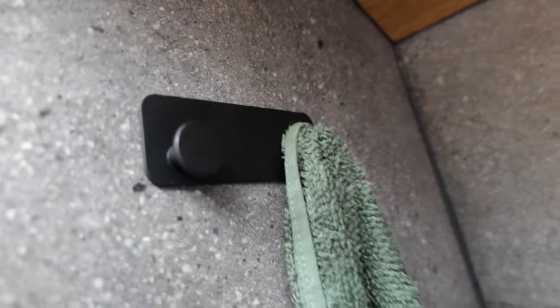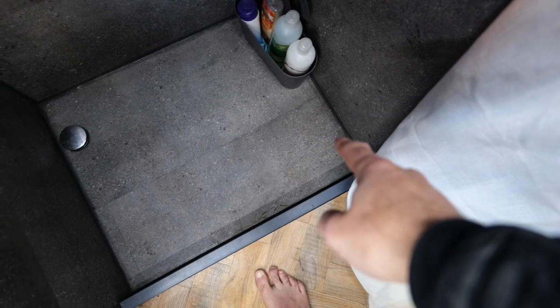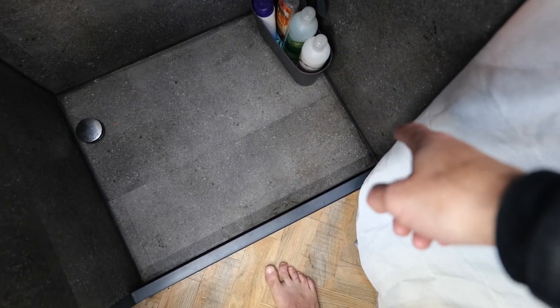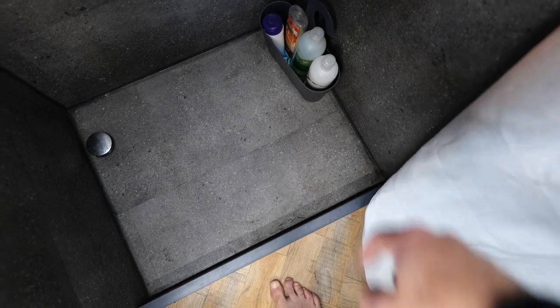And then we've just got a pretty standard shower mixer, and then we've got these little button shaped holders which have been glued and screwed on through the back of here. These just basically unscrew off. That makes a really good shower head holder as well. And that's pretty much it. It's just dead simple. I've got one outlet there, one waste there. I could probably put another there, because if the van's not level, then it will hold in that corner. But what typically happens is once you've put everything back in, you start driving, it all just drains out. But I think ideally it would be nice to have another drain there.